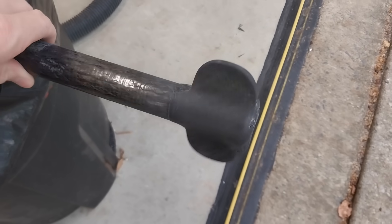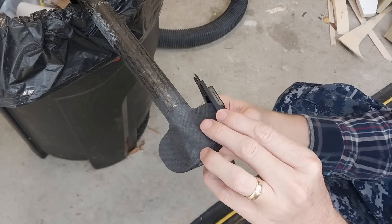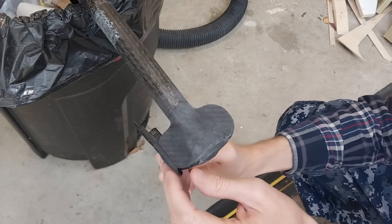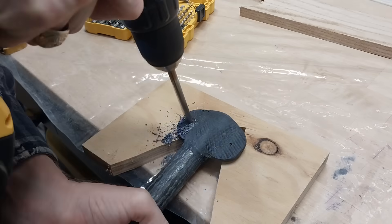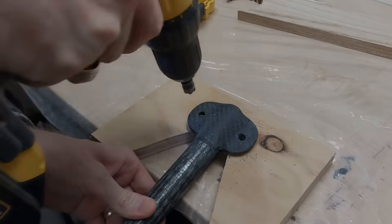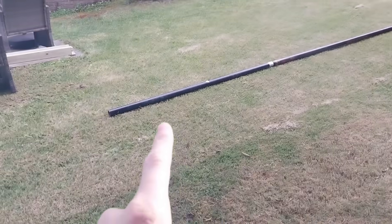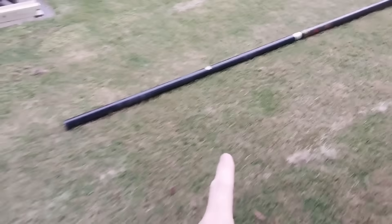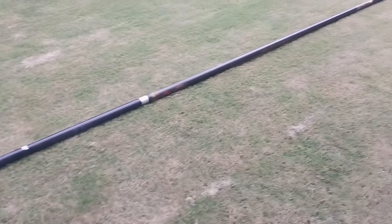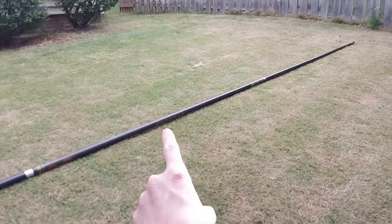That is really cool and quite easy to make. Now I just need to drill some holes. Let's check the final thickness — about five and a half millimeters on both sides. Let's take stock of things here: I've put it all together. I've got one bottom assembly of a windsurfer mast cut down to about five and a half feet, and then one complete windsurfer mast.